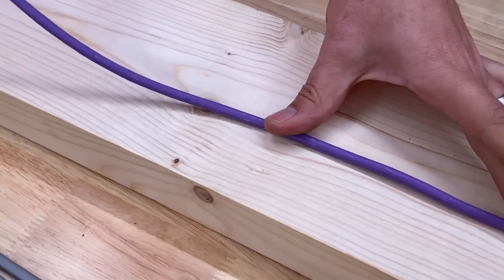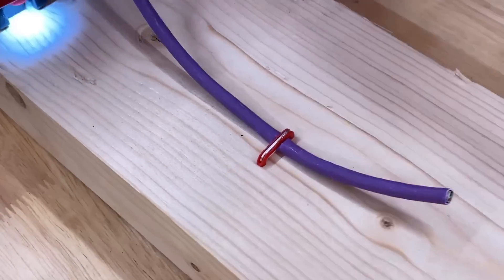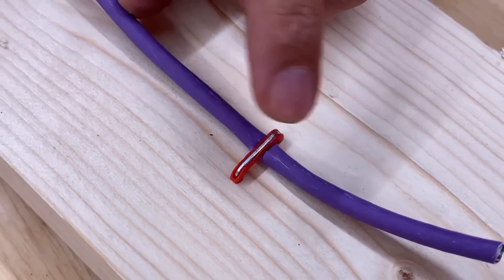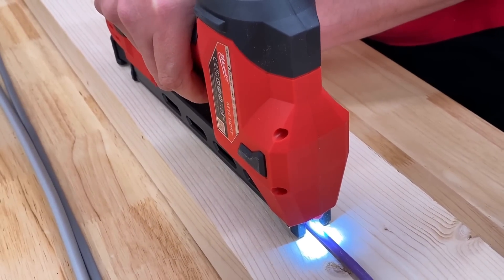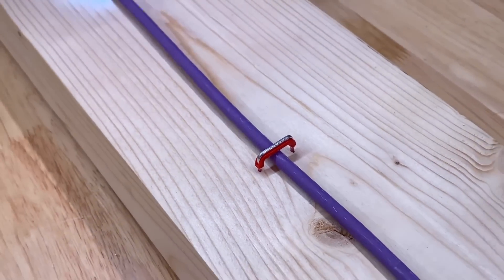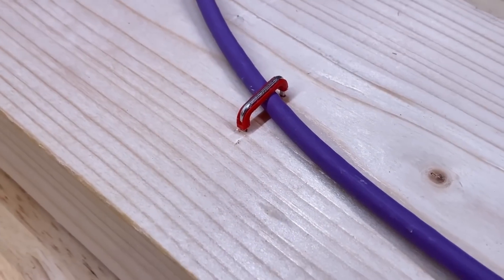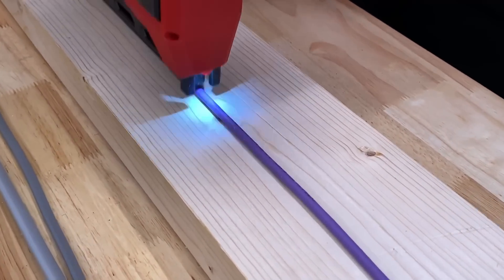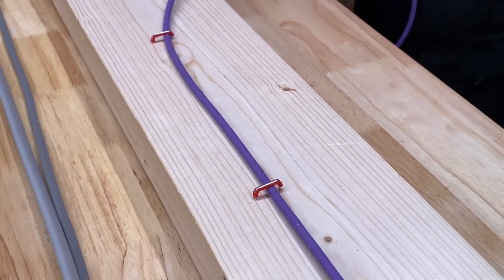So we've got some data cable here, and this is where a lot of viewers get upset — electricians doing data. What worries me, and the data installers who will already be in the comments, is that it's sort of squashed the cable, and that can affect data transmission rates. So I'll go a little bit lighter — just almost touching the cable without touching the wood. That's probably too loose, but it's supported. Imagine you'd given it to the apprentice and they can't make their mind up on the right pressure — you could end up in a challenging situation when testing the network. However, the instructions say it's for Cat 3, Cat 5, and Cat 6 cable, coax, etc.